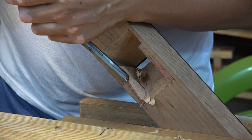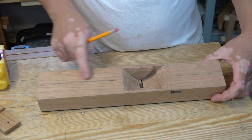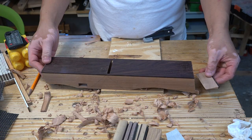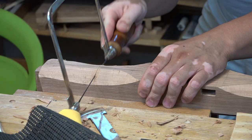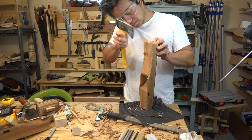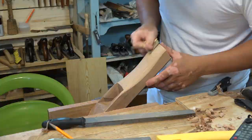Now I'm ready to do the final shaping. I've marked the center line along the top and I'm putting a nose line at 8 degrees, so it has a slant in here and a slant out there. I'm going to do most of the roughing out with an axe — an axe is actually an integral part of Chinese woodworking. There's an old saying: a dull axe is faster than a smart saw. After rough shaping, I used a rasp and file for finer shaping and smoothed it down to about 320 grit. After a couple of coats of linseed oil, the plane is ready to go.